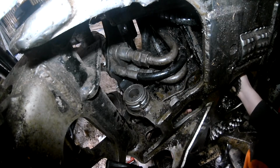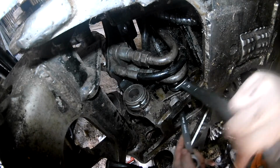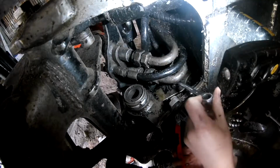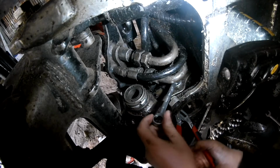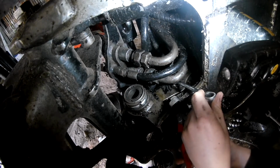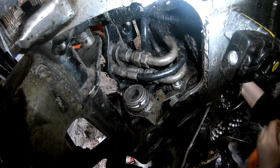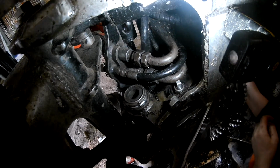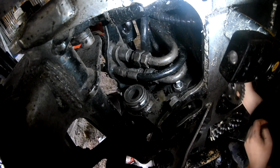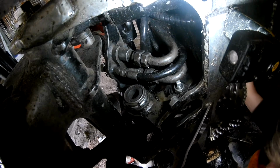Ended up having clearance issues with that pipe above it. It was touching the pipe and would be rubbing it so something would get damaged over time. We looked a little at it and decided that the bolt is a tiny bit too long sticking out of the nut, so when the clearance issue was discovered, we decided to shorten the bolt a couple of millimeters to give it a little clearance.